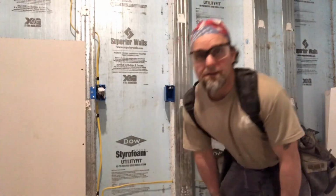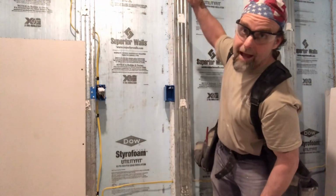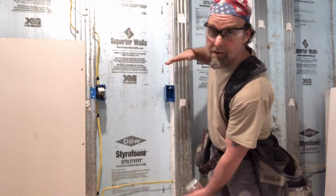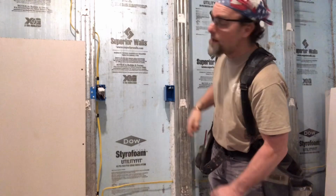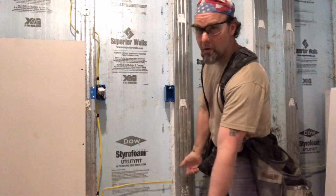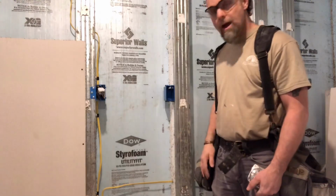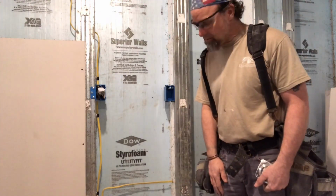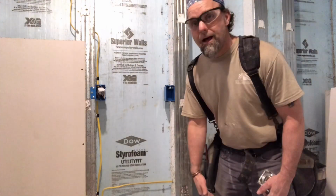A lot of times in residential, we hang the ceilings, then we set the top sheet up tight to the ceiling, and we work our way on down the wall, lifting the sheets up and abutting them into the upper sheets. Other times, in a basement like this, you may be standing your drywall right on the floor.